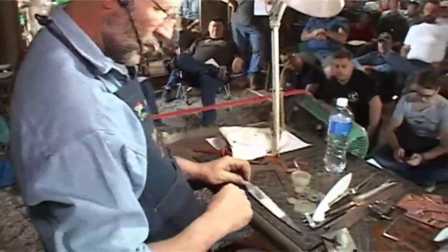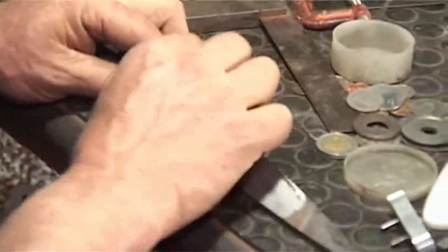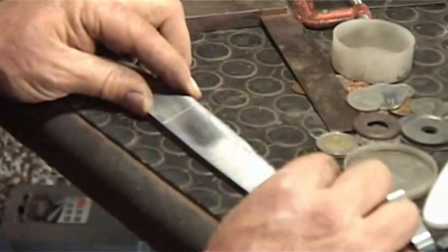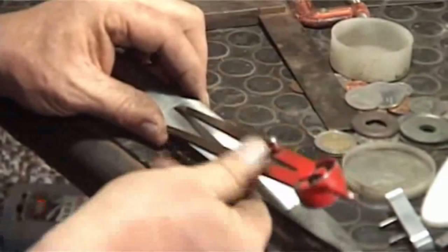I want a converging ricasso. I don't want the grind lines to meet perfectly in the middle right at the ricasso. I want a little flat triangular ricasso extending down the middle of the blade between the bevels. So it's not going to be full height. And this forces me to grind to the line perfectly and no further. So I'm going to decide on a grind height that is not right up to the middle